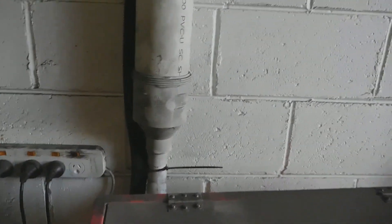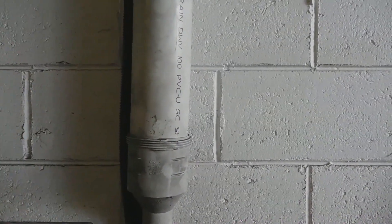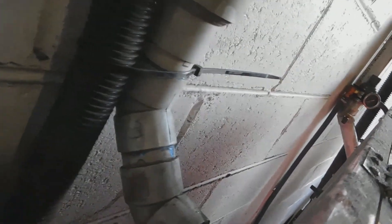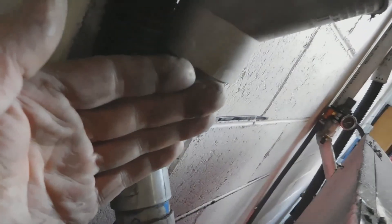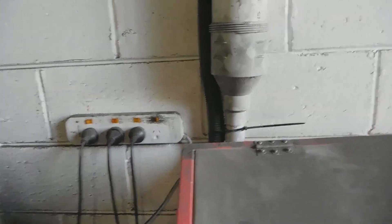Tube size — you want a tube that's big enough. If you've got a bigger vacuum cleaner and a bigger cabinet and you're really sucking a lot of air, you don't want the airspeed in there getting up too high and starting to pull the heavy materials up. You could double the size of that tube — if you can get it, you might as well make it bigger. I've probably got too many bends in here, and I get a bit of accumulation that fills up and the hole gets a bit small and keeps dragging it up. If I did it again, I'd probably go at an angle into the cabinet so that it's got a steep slope all the way down and slides back down without jamming. That's another improvement you could do if you were going to make one.